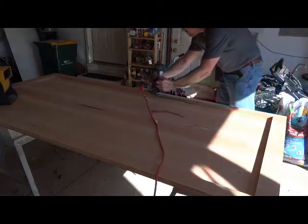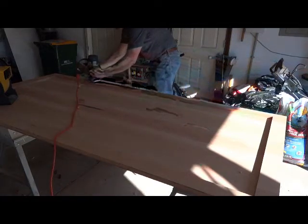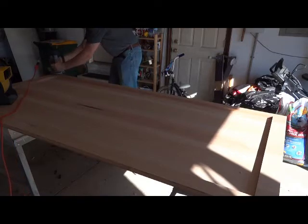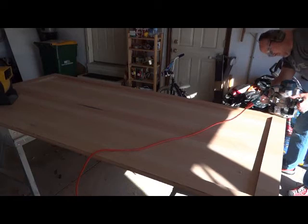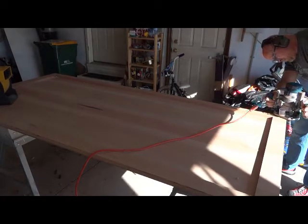And then this is the underside of the table. Just, you know, wood planks glued up. Nothing special there. I cut the table extra wide and extra long, and then glued those pieces on to the bottom, which you're seeing now. And that gives the appearance of thickness without having to have a really heavy table.